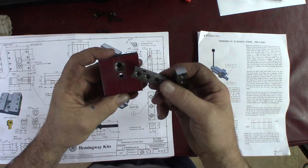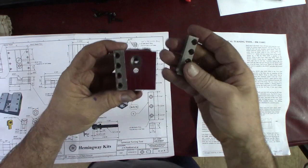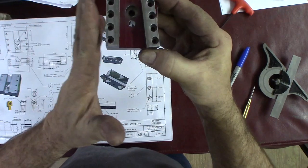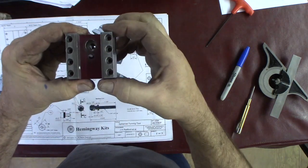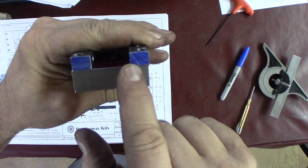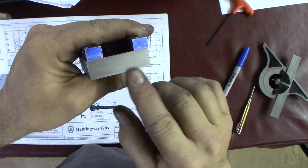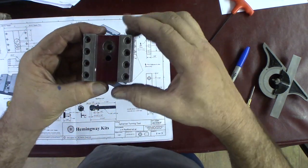This is the head that we got to this point in a previous video. These are going to go this way and this way — they're going to go on here, flush on this side and on the ends the screws will be to the outside. If you can see the scribe lines, we're going to mill this into a dovetail on each one of these, then the slide piece will be sliding in there. So first off we're going to attach these on here — that's the next step.